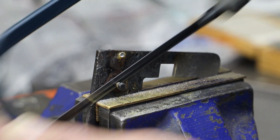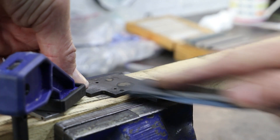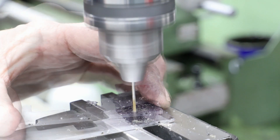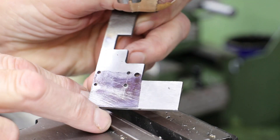Because the bolts are slightly shy of the surface on the other side, I flip the motion plate over and do the same again. With the bolts now soldered in position, I cut off the heads with the hacksaw and get to work with the file and some Emery to remove all trace. I then re-mark the holes correctly this time, centre punch and drill through. Job's a good'un.